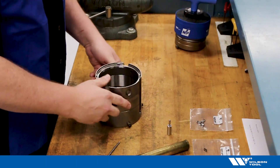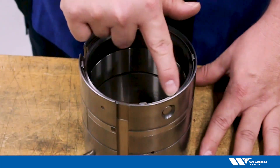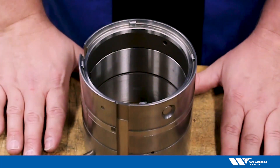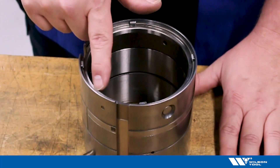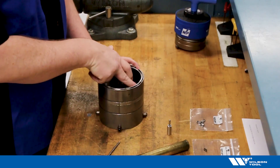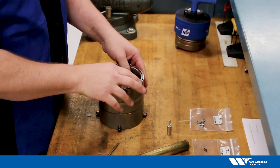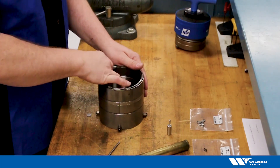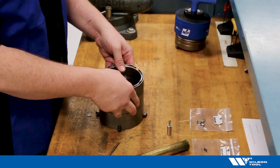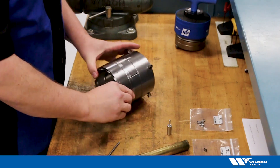Flip over your guide and we're going to start with a little maintenance. We'll want to clean the inside lip of the stripper retention system and open the retention system. A little more housekeeping on the inside ID of the guide — now's a good time to check for any scoring or chip buildup. Then we'll move into our special pin removal process.